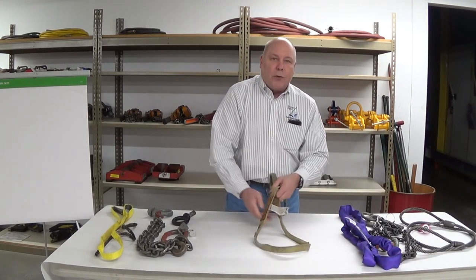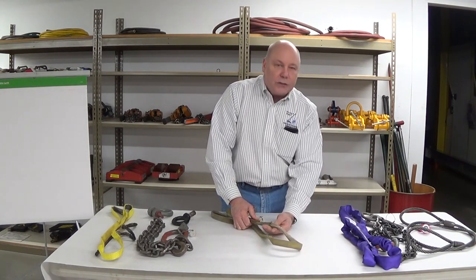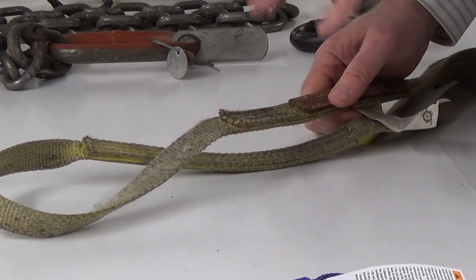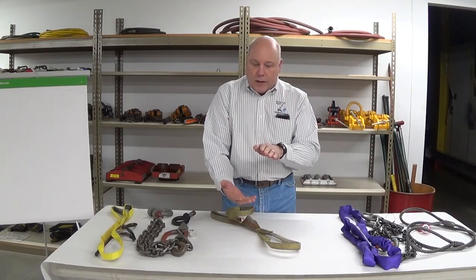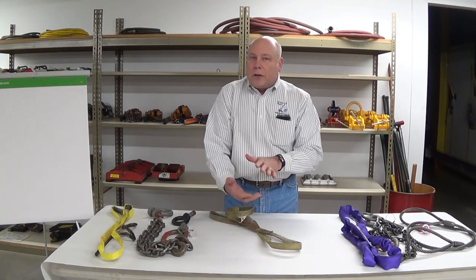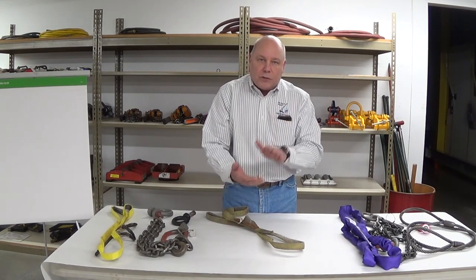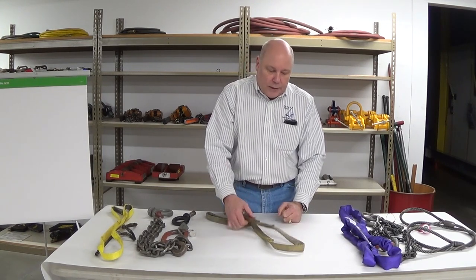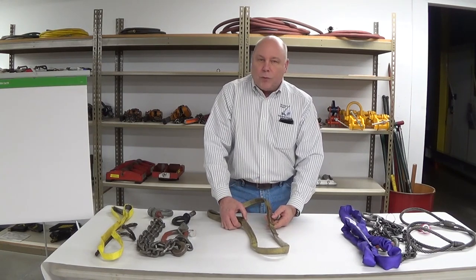We probably won't have an example for every sling or rigging type we're going to talk about, but this is certainly a great case study. We should be very cautious about using damaged slings of all types because the breaking strength reduces while the working load stays the same — our effective design factor has changed. With any dynamic loading we can blow right through that piece of gear because its ultimate strength is actually reduced significantly. We want to be very respectful of damaged rigging and respond quickly — when we see that damage, we want to get it out of service.